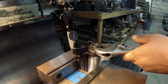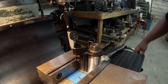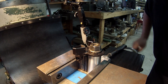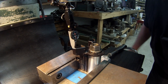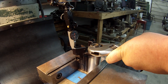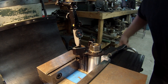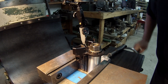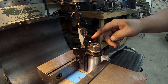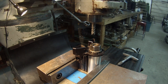You can see everything trying to move around as I tighten this up. We're back on 15 — just over a half thou. Now it's about a thousandth and a half off, but close enough. I'm just going to live with that — it's showing a thousandth off. I'm hoping I've got this tight enough because I don't want any mishap when I'm doing the milling. I'm going to call that straight. We'll come in and do some milling — I'll keep the cutter to the backside so that if it tries to kick the part around, it'll hopefully push it that way.